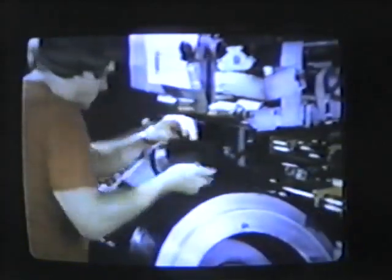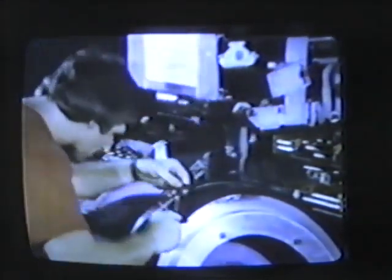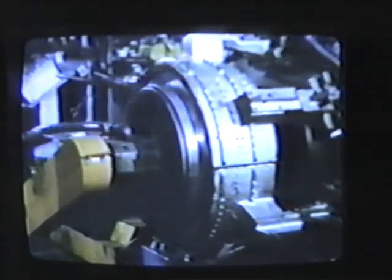The builder is assisted by guide lights as he places the second stabilizer ply with its steel cords intersecting at an angle opposite to that of the first ply. A heat lamp warms the cut ends of the tread section to make them tacky just before the operator rolls the tread onto the stabilizer plies and splices it together. The warm splice is stitched down to assure a firm, cohesive bond. The building chuck then swings into a grab arm whose mechanical fingers remove the band assembly.